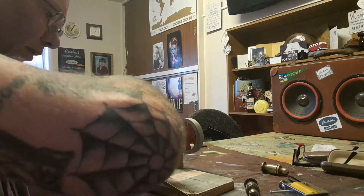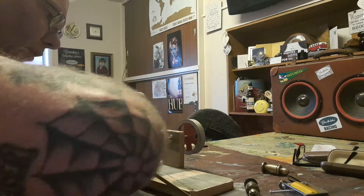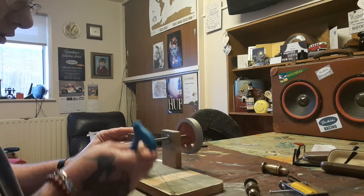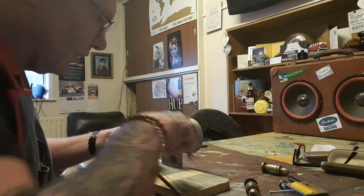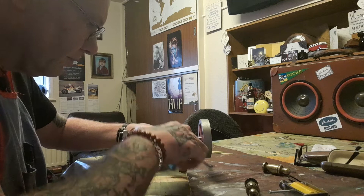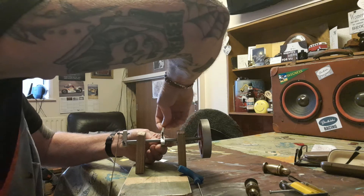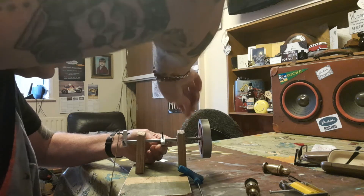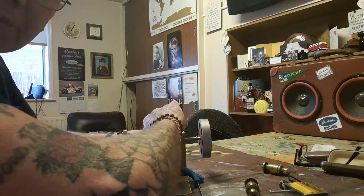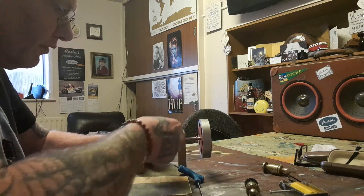So I need to tighten them up. That goes right here — you can see now that that is the crankshaft. That goes like that, you can see that. And then we've got this one in here, I need to tighten that up. So this is going to be operating the switch, to switch the solenoid on and off at top dead centre, or just after top dead centre. It's all a bit fiddly for me.